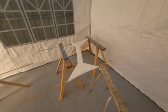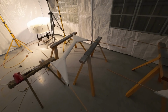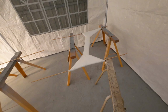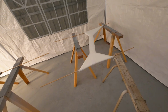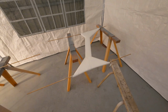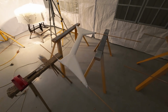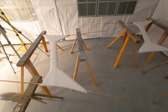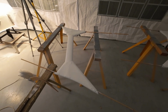I've painted the primer on these two interplane struts. So they've had all of their high build primer, the Eco Fill, the Eco Bond, and now the Eco Prime, which is the white stuff. And the only reason we put the white stuff on is because there's a light colour finish to go on top of them. Tomorrow, but maybe the next day, these will hopefully turn orange.